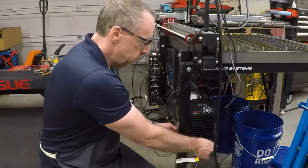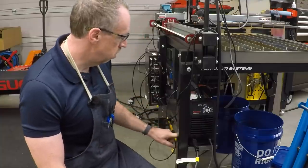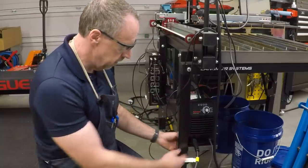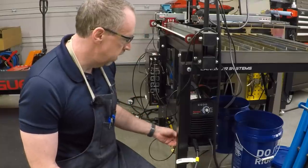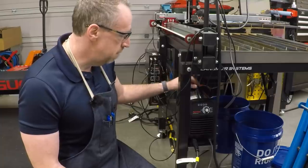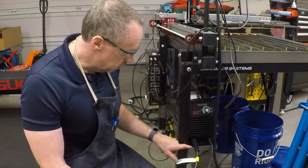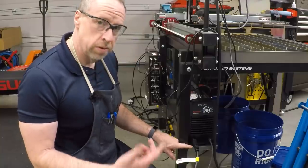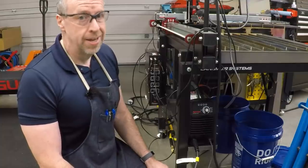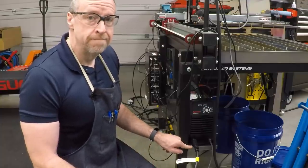This ended up, even though this is only 20 gauge sheet, it ended up being really strong. I mean, this thing is rock solid. Once you hem the tops of the sides, spot weld the corners, and then everything's triangulated with right angle bends, even this 20 gauge sheet is plenty strong. It's maybe even overkill for this application. But I'm very, very pleased with this. Now, I do live in Idaho where things are dry and they don't rust, but this 20 gauge mild steel sheet, it's probably gonna rust. I probably should pull this off and paint it.